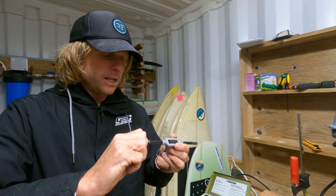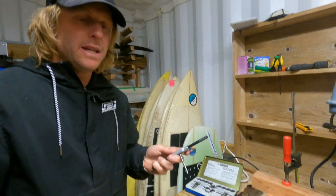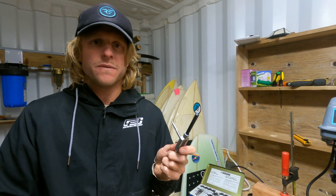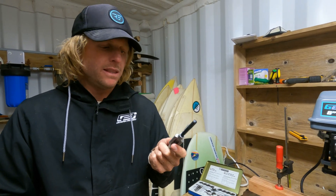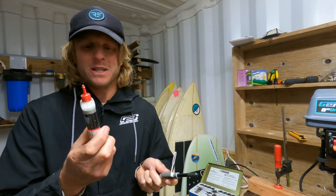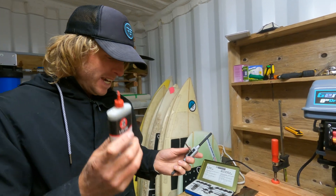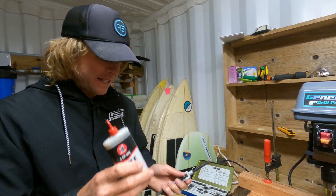I'm just going to put it in the tap. You definitely need some lubricant. There are specialised lubricants for tapping that are definitely better than what I have, but I was at the hardware store and they didn't have any. So I'm just going to be using this 3-in-1 oil that I've already used for a few different things here. It does work — it's not the best, but that's what I'll be using.